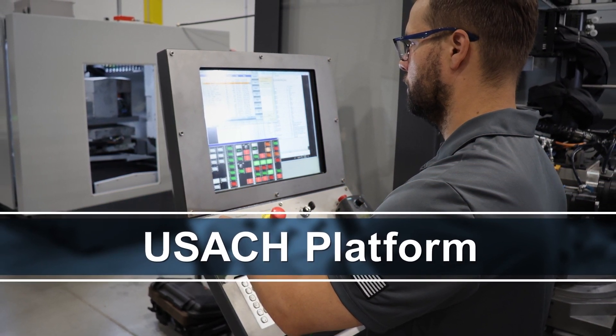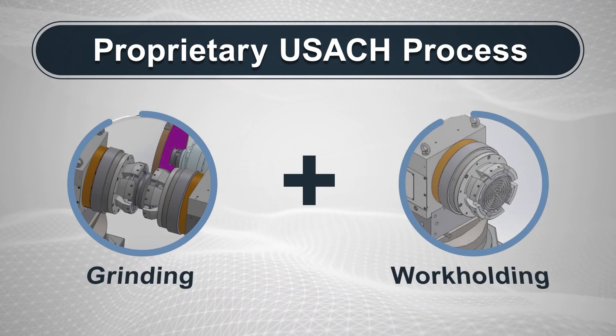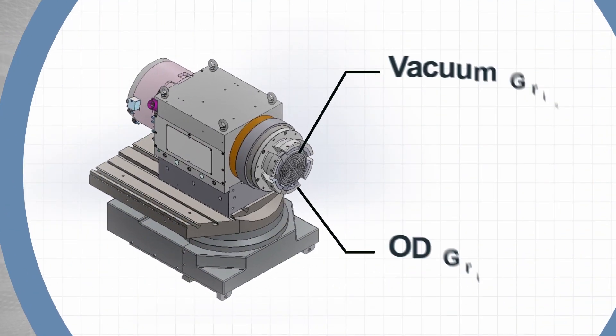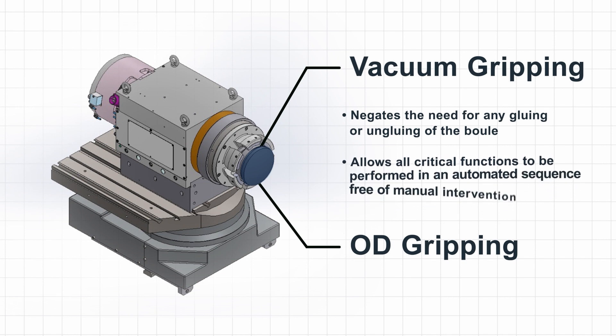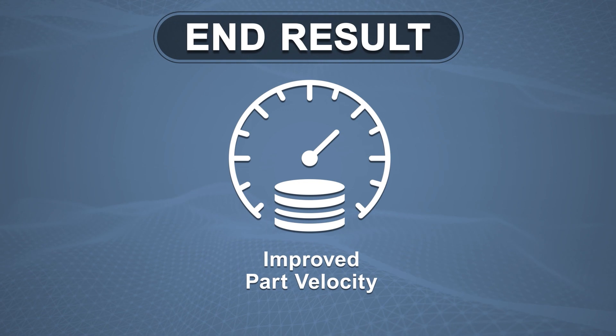The proprietary USAC process combines specialized grinding and work holding, including multiple work heads and custom fixturing with vacuum and OD gripping, in a single setup. This negates the need for any gluing or ungluing of the boule during processing and allows all critical functions to be performed in an automated sequence free of manual intervention.